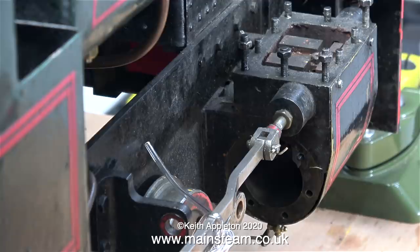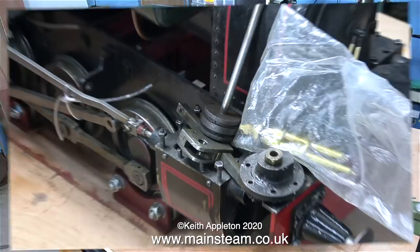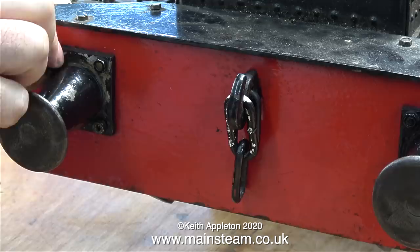When I first looked at the missing parts, I thought to myself, oh no, here we go — a machining frenzy. But no, the missing parts are all there in a polythene bag, and now the parts are in a plastic pot that was in the polythene bag. I'll lay them out on top of the cylinder so you can see what's what. I can see the piston, the crosshead, the crosshead guide, the rear cylinder cover complete with the gland nut, and in the polythene bag, a three-chime whistle. I'm going to have a look at why these buffers are broken.